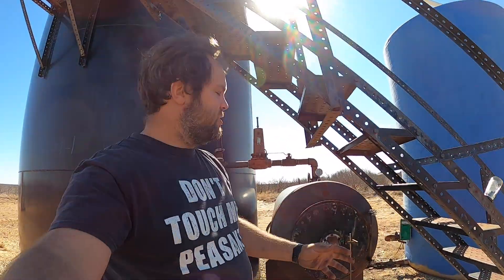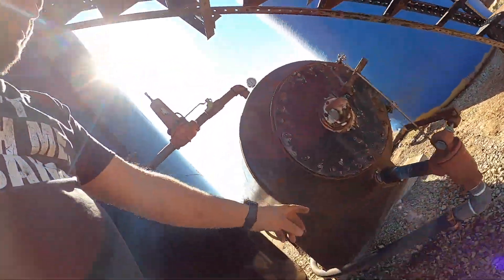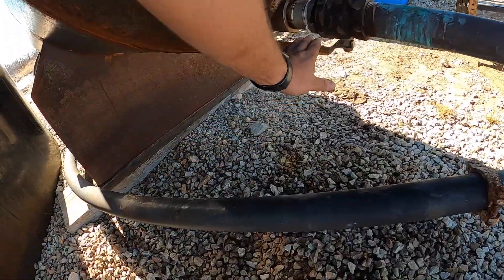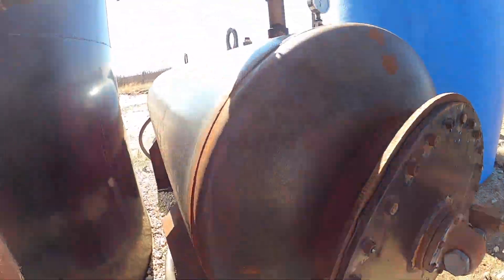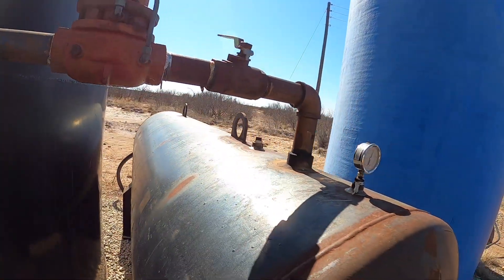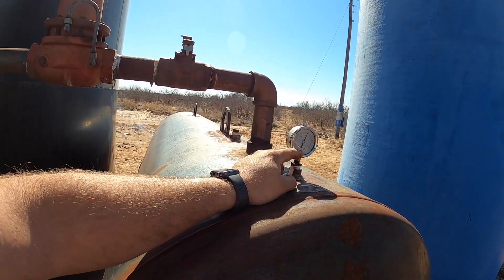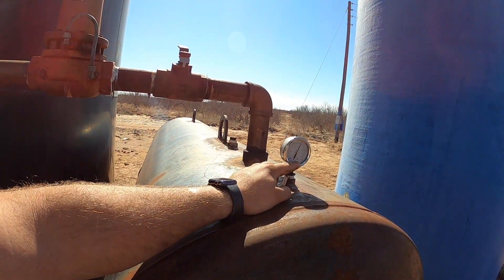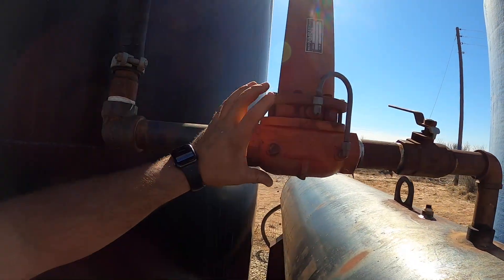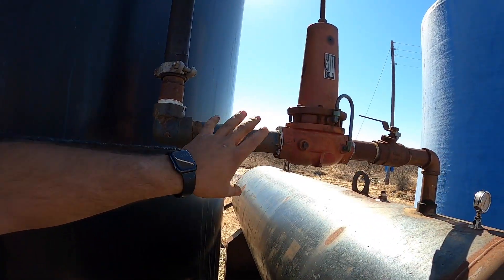I think there's probably a piece of rubber stuck in this valve. So what I'm going to do is shut the valve — there's a valve down here on the water dump. We're going to shut this valve and let this thing pressure up. I'd like to get it up to about 20 pounds, but I don't want to spring my gauge. Maybe we'll see if we can get the gauge to point straight down. At that point I'm going to jerk this valve open — it should fully open the dump valve, we'll hit roll in the tank, and hopefully blow whatever's in here out.